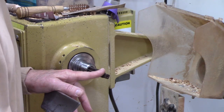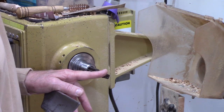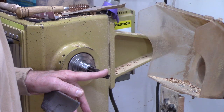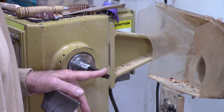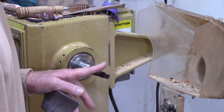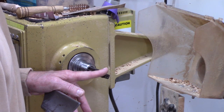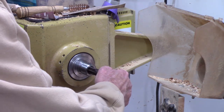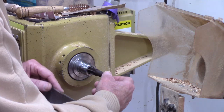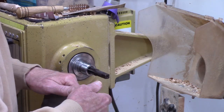When you're using a reamer, you're not trying to fully restore a shiny internal surface — you're just getting the high spots off. Use cutting oil liberally on the reamer; if you don't have cutting oil, use some other type of oil or wax. A dull reamer is the same as no reamer. Use a tap wrench or two wrenches to turn it. One other important thing: always turn in the forward direction and never reverse. Always go in the same direction, then pull it out to extract it.